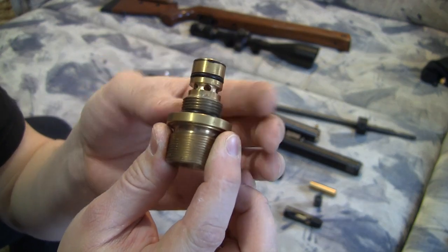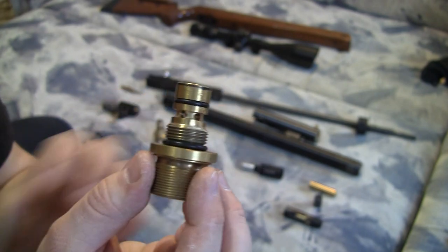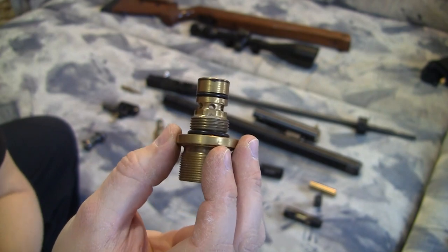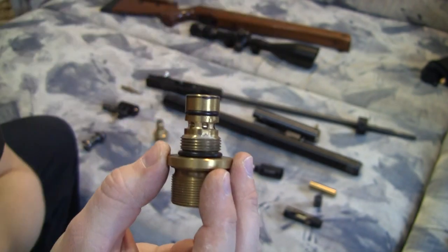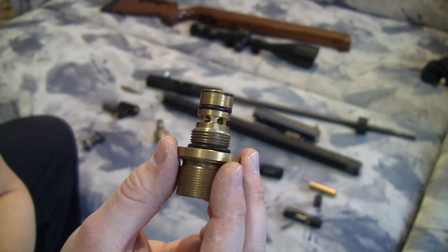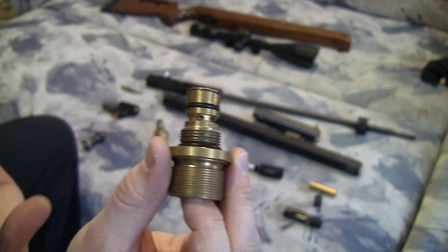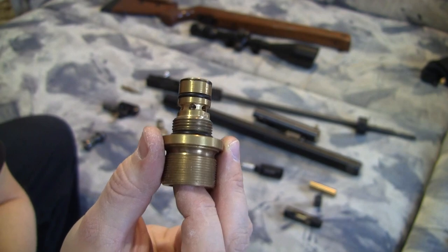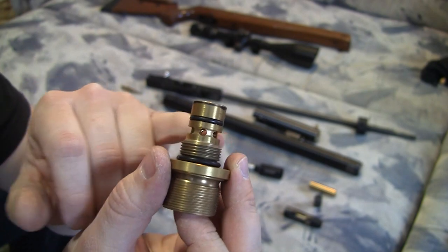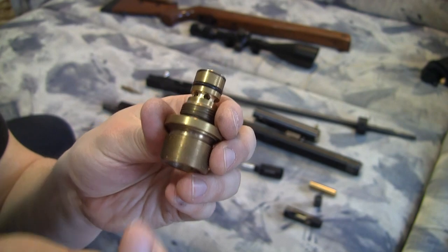And these holes, of course, have a certain air capacity, which is not wanted in regards to efficiency. You get a lower efficiency if you have a big chamber after the valve, before the pellet. Regarding efficiency, this is like you would have a bigger caliber, because bigger caliber, bigger barrel has bigger volume for air. That's why you need more air. And over here, you lose, because you have a lot of air here, and this air doesn't do any good to you regarding accuracy or power.